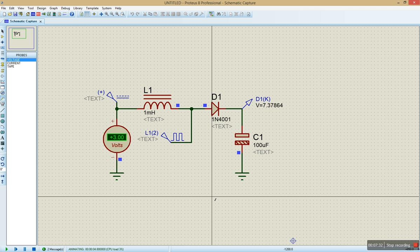This is because of the principle we just implemented — adding a continuous pulse which does that for us. If you take note of the voltage, you realize it's increasing — the first charge of three, second charge of three makes six, and so on. Because there isn't much force coming in, we have slow charging, but you can see the voltage is going up. That is what happens if you use a regular diode — it's going to go up to its breakdown voltage of 50 volts, charging until it gets there, which is not good for design.